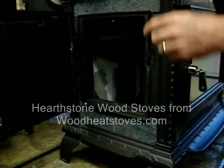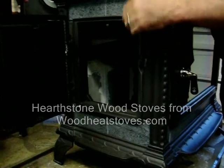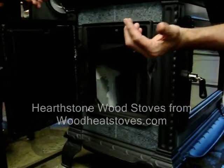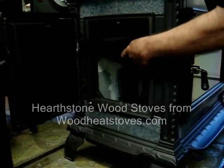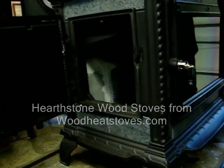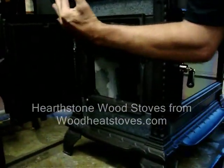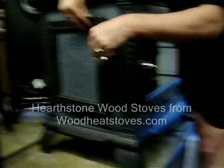What's the white stuff I see on the inside of the firebox there? Instead of refractory, which is common in most stoves, or steel or cast iron — which are more likely to break or warp over time — this is actually solid soapstone. You're looking at the inner portion of the inch-and-a-quarter thick solid soapstone that the body of the stove is made out of. The heat saturates from the inside to the outside, penetrating through that way and delivering it into your home.